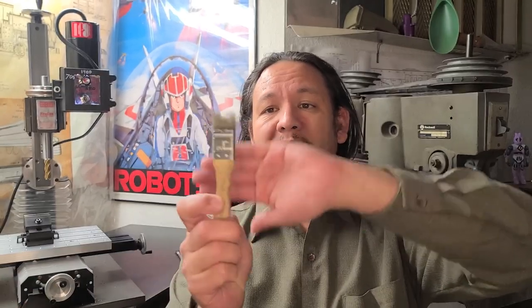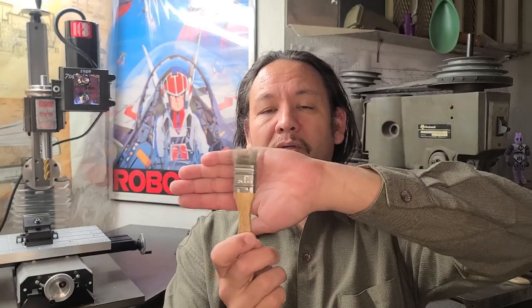The simplest and most avoidable mill crash that was self-induced by me was feeding a brush in to clear away chips into the wrong side of the cutter. Being careful and being aware of how to clear chips is fundamentally important.